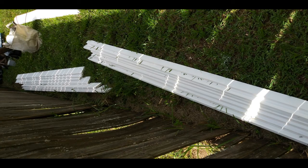I think that exterior trim should be primed before installation, and to save time, I purchased pre-primed 1x6 pine. I also got lucky, and when I ripped the soffit to width, the leftover strips were the correct width for the secondary strip. Before installing them, I took the time to prime the exposed edges that I cut.